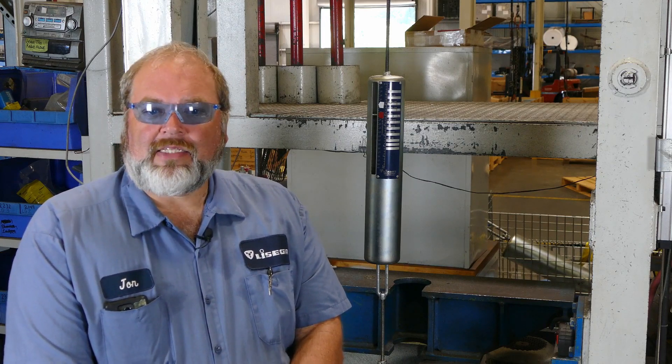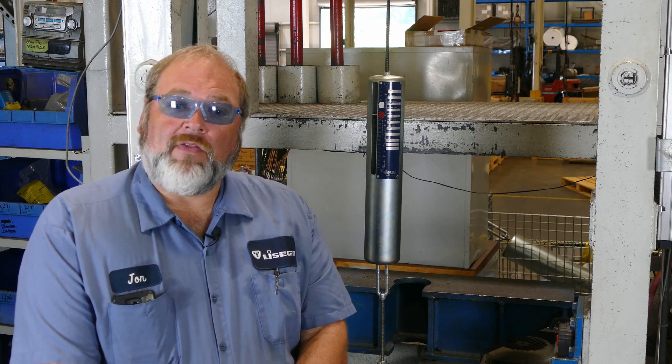Here I have set up a type 21 D3 29 spring hanger that has its current load set to 50 pounds. Let's say that the line conditions have changed and the site engineer wants me to set the new load to 56 pounds — that's a six pound increase. At this point we know the current load and we know the new load. Those are two of the three pieces of information we need.